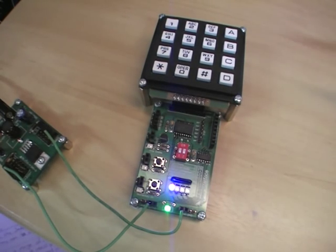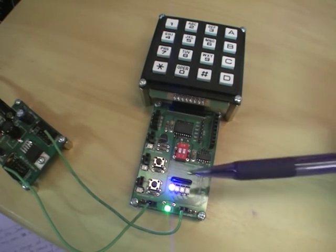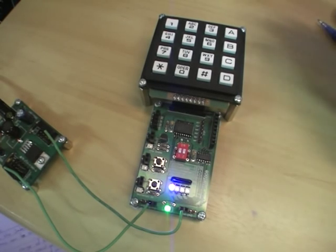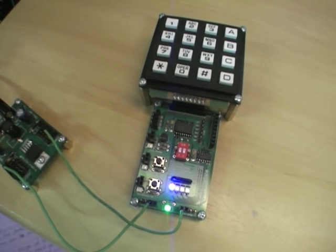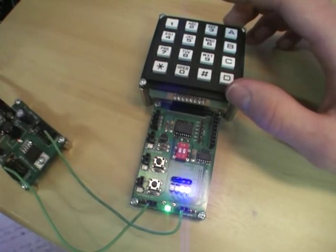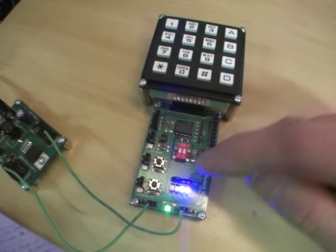More functions include chip enable, push on, push off, and momentary on outputs — these are the three here. Chip enable goes high when a key is pressed. It also comes with an inverted output for components with active low. The push on, push off, and momentary on outputs use tactile switches to perform their respective functions.